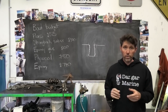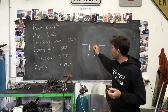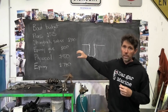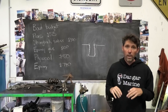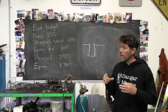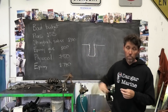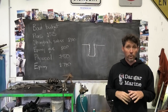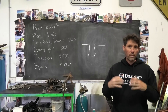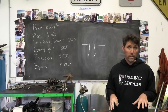There are plenty of reasons why you wouldn't want to do that. Some situations you don't have enough spare metal; other situations you can't drill a hole through the thing you're bolting onto. Another reason is if this is one of say ten holes clamping something large — you're going to have nine bolts with a ten millimeter head and one bolt with a thirteen millimeter head. So maintenance down the track gets tricky. It also makes it harder to get an even clamping force across all the bolts if they're different sizes, even at the same torque setting.